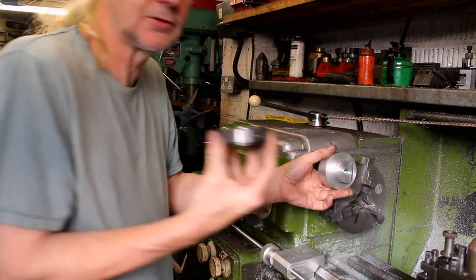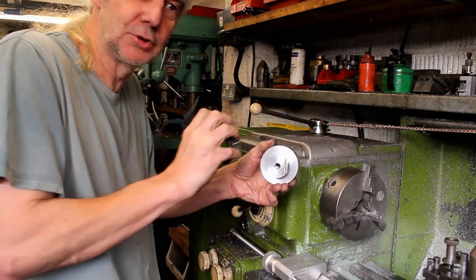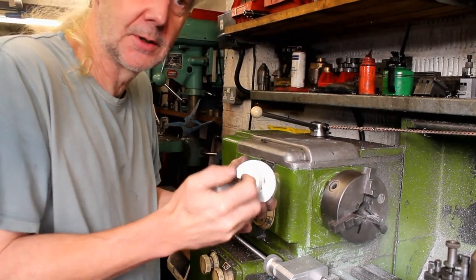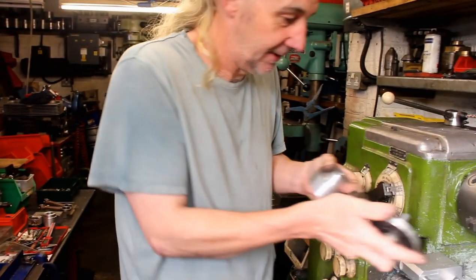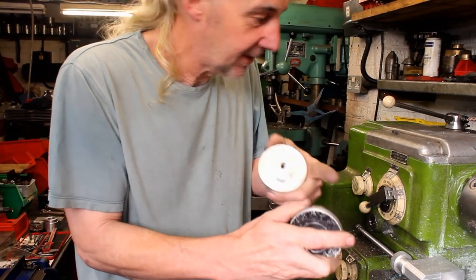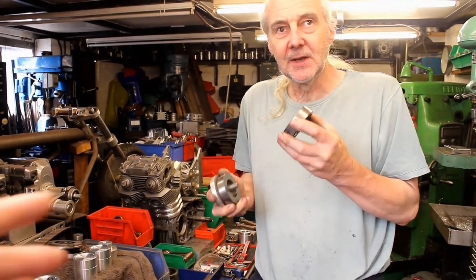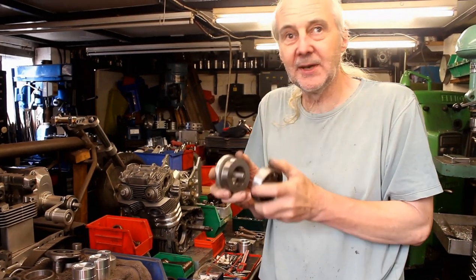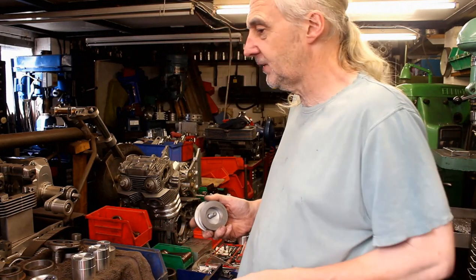And I've got these, so you've got two cranks. I'm going to machine that until it's literally just a push fit, so it's spot on. Then, once the steel ring's on it, you put that on it, clamp it with that, and then you can machine the steel ring to the same size. So it's a way of clamping that ring to be spot on. It's got to be spot on because of the roll, a quarter of a thou-ish.